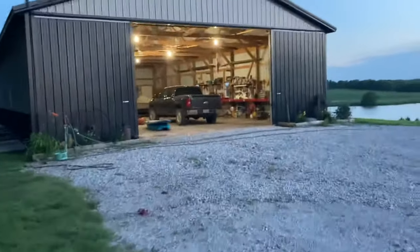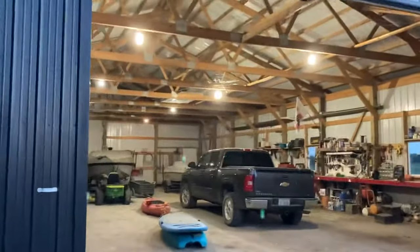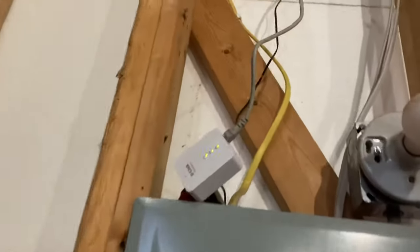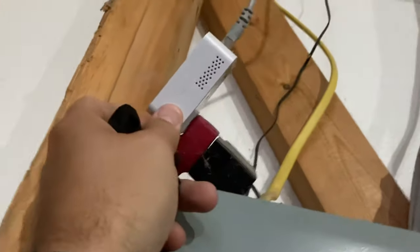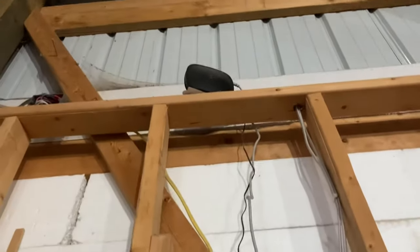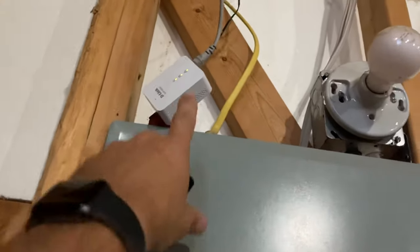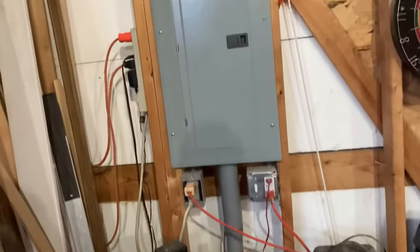It comes with two devices. One end you plug into an outlet in your house, and the other end you plug into an outlet in your outbuilding. I just mounted it right here — this is it. All it is: you plug it in at the back, and plug the other end into a little cheap router up here. The one in the house has a plug into the outlet and then an ethernet adapter that plugs into the router on the inside.